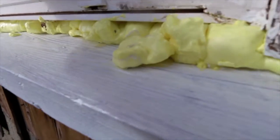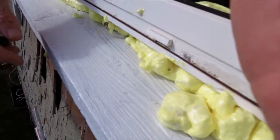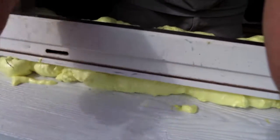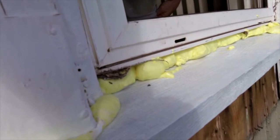What I did - it was basically a rough cut two-by-six generally speaking, so I just got another rough cut two-by-six and cut that to size. I had to dig out the sill that was in there because it was in there good and there was a lot of dry rot throughout.